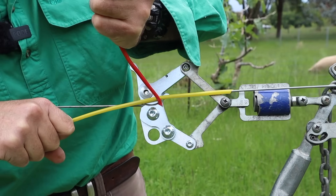So now without the fancy colours, we've got our line wire in the rear jaws of the strainer, and we've got the wire that goes to the end assembly over the top of the chain. I'm going to bring the two wires together. I'm going to bring the strained line wire up as tight as I can. Now you'll see that it's going over the top of the other wire that I'm holding in place. Now that means as it completes its turn, it's got to be brought behind the other wire so that we follow the under and over rule. Under here, over there.